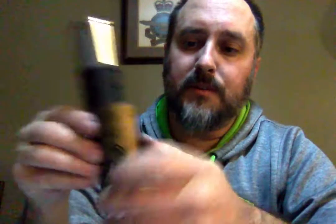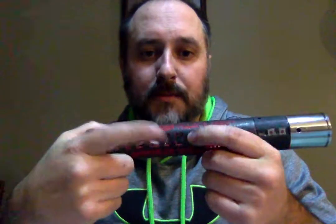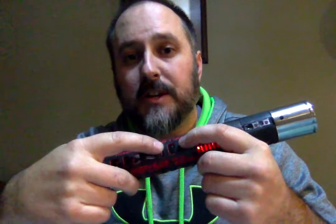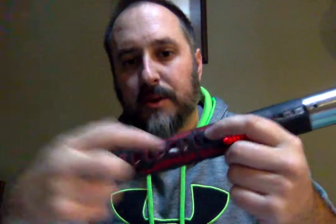The batteries do not come out, so there's a recharge port. What you've got in here is USB recharging. The way that works is I've got a TF Robotics card in the back that takes that lower 5V signal and ups it to 7.4V. So the charger is lit up - it will show you a red light for charging and a green light when the battery is fully charged. It is protected so it will not overcharge or fry your batteries. It's a protected board to charge up your batteries. Nice and simple, nice and easy.